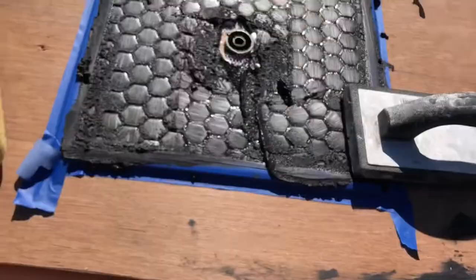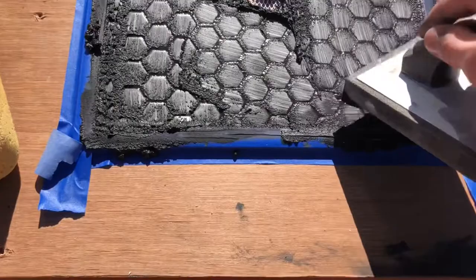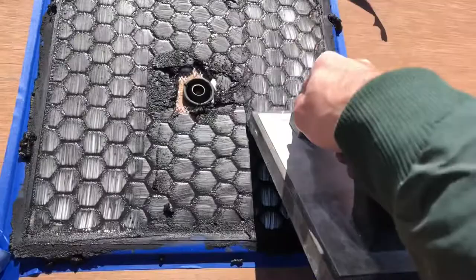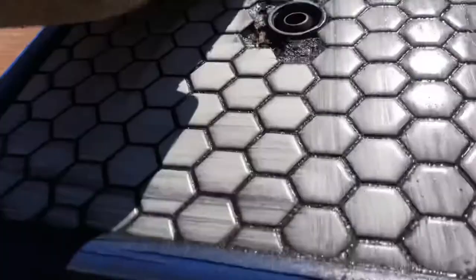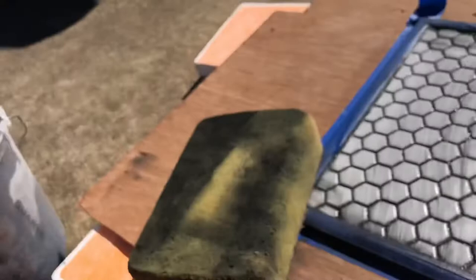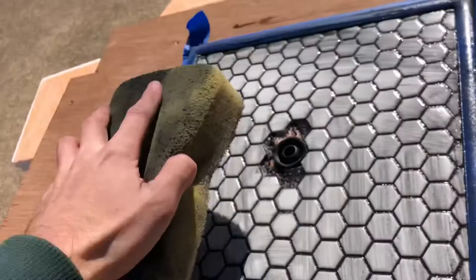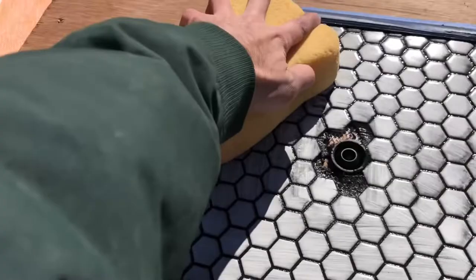And then once that's pushed in there, you get a sponge — a damp sponge with a clean bucket of water — and you wipe all the grout away and wait a little bit and the grout will dry. Then you wipe it again and you just keep doing that process until it's all clean. And it might freak you out a little bit when you're doing it, but just keep pushing it into all the little joints making sure it's nice and clean. And then when you got some excess, just peel it away, slowly revealing what is left. The sponge is also necessary for getting all the lines in the grout uniform so they kind of have that same little dimple in it.